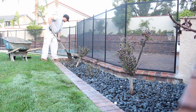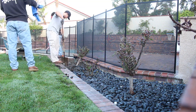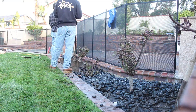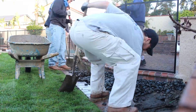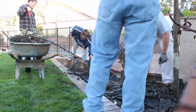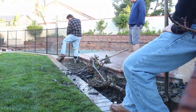You're going to get weeds, dirt, constant cleaning and maintenance. So we're going to fill it in with concrete. We're going to leave three small 16-inch diameter circular planter spots to put some pots in, and we're going to reroute the water so we have water in each of the three planter circles.